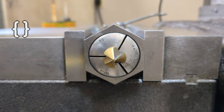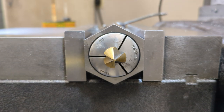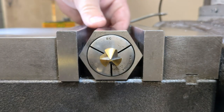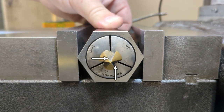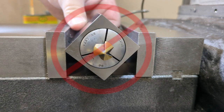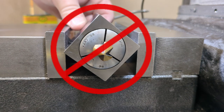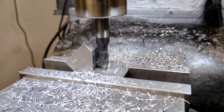With a hexagonal block, you can actually index by 2, 3, 6, and 12 — kind of. Because one of its factors is odd, you can index the block either with a flat side down and two vertices against the vice jaws, or you can put two flat sides against the vice jaws and have a single vertex sitting at the bottom. This doesn't quite count though because it changes the height of the axis of the part being held. For a lot of operations that would be a problem, but it can still be useful for drilling holes or cutting flats with an end mill. You can't do it with the square collet block, because you'd have vertices on all sides and lose the strict clocking. Without flat faces to mate with the static jaw datum of the vice, it'll end up at some random angle. But what if you had a little 45 degree angle shim in which the point of the collet block could rest? That would firmly hold the angle, and you'd be able to index 8 sides.